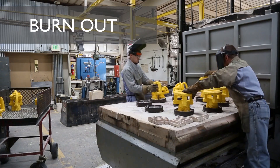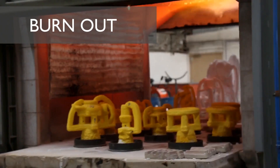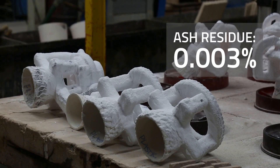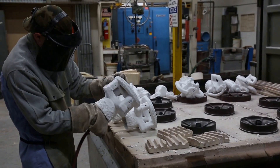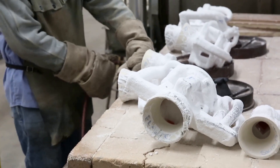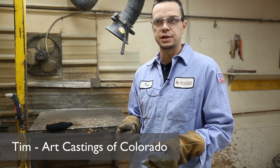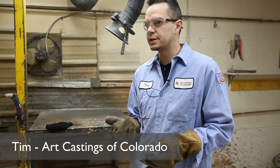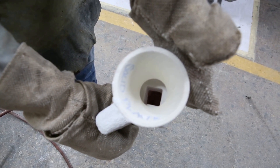The parts are placed in a 1600-degree kiln for a full two hours. Polymaker boasts an impressive 0.003% remaining ash residue, and the foundry techs were quick to mention how much better the Polycast burned out than other plastics they've seen in the past. One technician noted: 'One way I test to see if there's debris in the shell is I blow air into it, and if any embers come out, I know there's still plastic in there — but these plastics seem to have less debris inside the shell.'